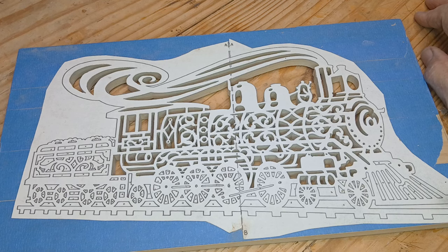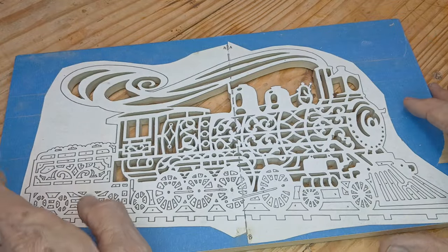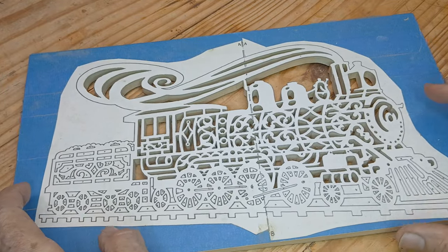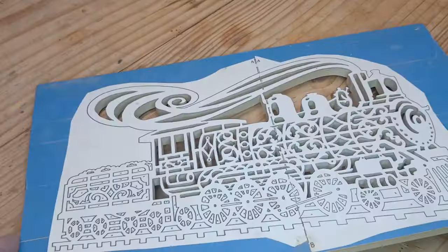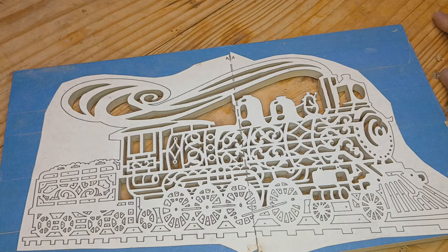There are three criteria that I consider when I choose a blade to cut a project. Number one is the thickness of the wood — in this case, this is 3/8ths. Number two is the density, the species of wood. This is a nice pine — not a construction pine, it's a nice piece of pine, very light and it cuts very easily. Softwoods like that give you a wider range of choices in blades; you can get away with a smaller blade. So looking at this piece, my first consideration is what size blades I'm going to need.